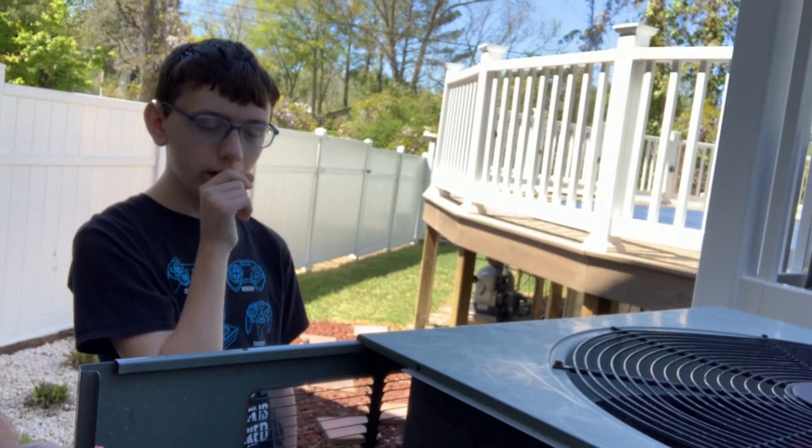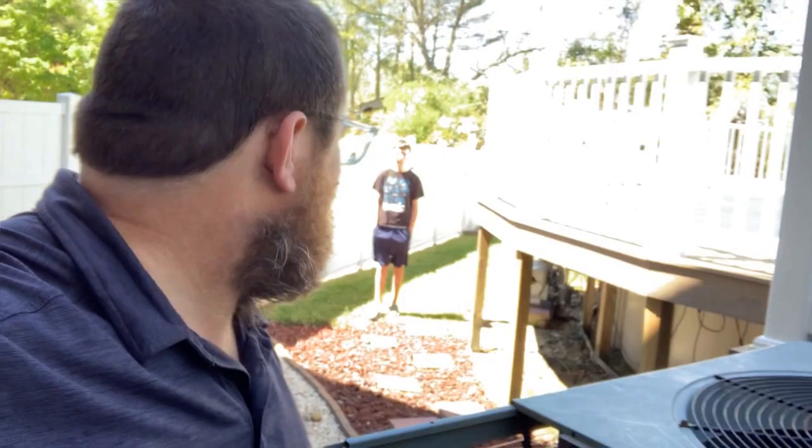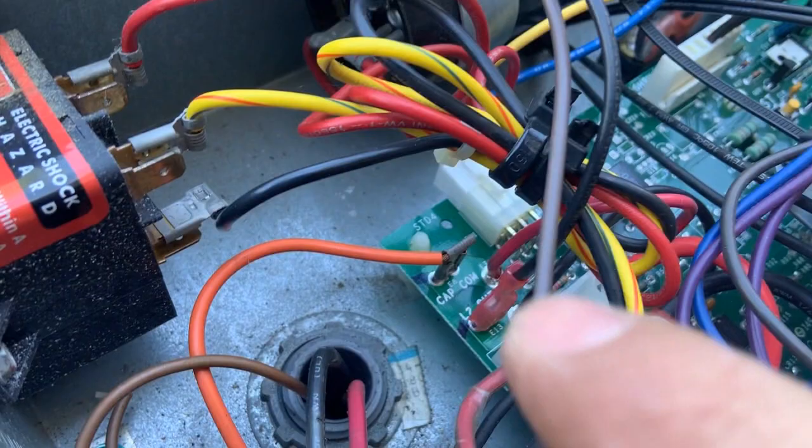We have four wires. The blue and yellow go to the same color terminals — blue and yellow. The brown and the black connect to terminals down here, so you can't see those. Blue and yellow are low voltage; black and brown are high voltage. We put all of our trash into the motor box when we're done. We've tightened up our wires — brown heading over to the capacitor for L1, L2 on the board with the black. That's our 240 volts to the motor. Our low voltage is tied together with the male and female STACONs tucked over here on the side.